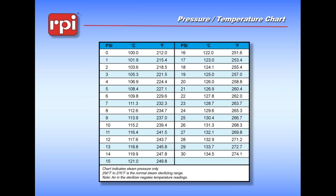If the machine over-pressurizes before you get into the proper temperature range, you've trapped air in the chamber. Air will pressurize quicker than it heats, so you will raise in pressure long before you raise in temperature. Boyle's Law always applies, except when you're at altitude. If you're in a place like Denver, Albuquerque, places that are above a mile high - top of Kilimanjaro or someplace - this no longer applies, and there are corrections for that based on altitude.